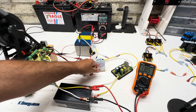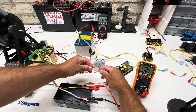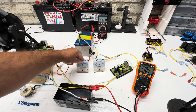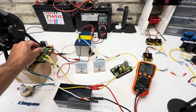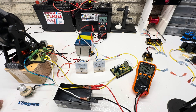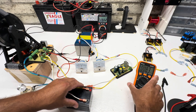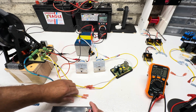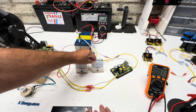Let's get this back hooked up. Generator mode works really well for charging batteries — we're using 200 milliamps into a 3.3 amp-hour battery. If you go to SG mode, your charging rate goes way down. You can see the battery voltage dipped a little bit. So let's disconnect the charge leads — now we're pulsing back into the primary battery and you can see the battery will start gaining charge, coming back up, which is pretty neat.